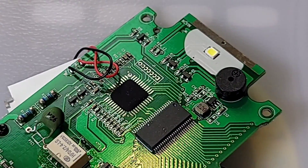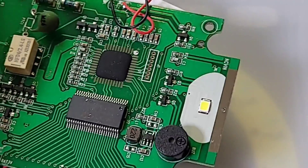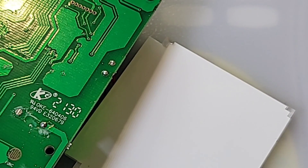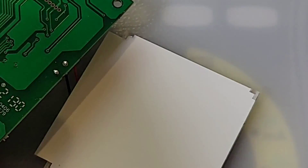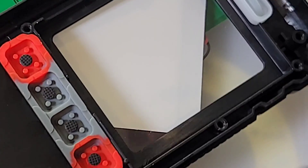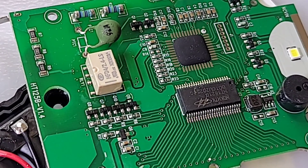For NCV, I'm not seeing anything special — just a metal tip at the edge of the PCB, no extra fill or anything. On the other side, it's super plain. The headers make contact with the reverse side of the display — there's the zebra strip elastomer. Nice clean housing overall. This is the backplate for that display. It's the HT125B version 1.4 — a tiny but well put-together little beast.